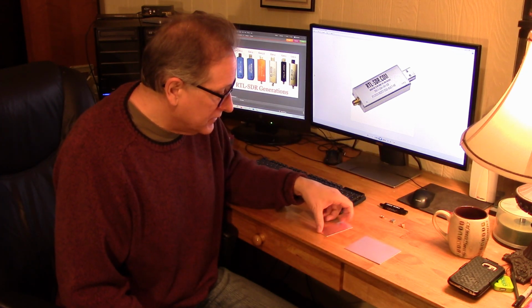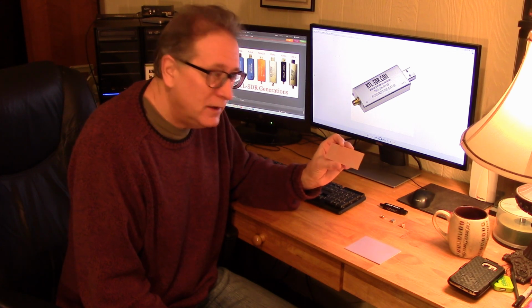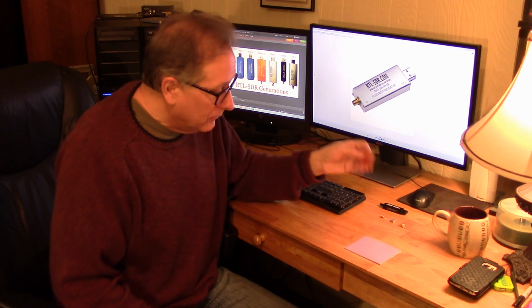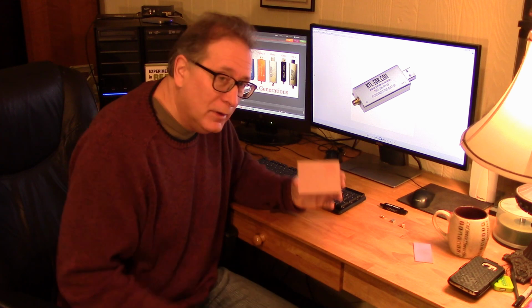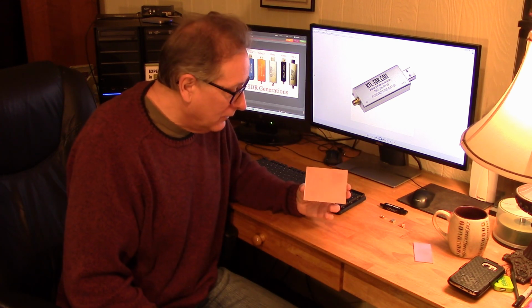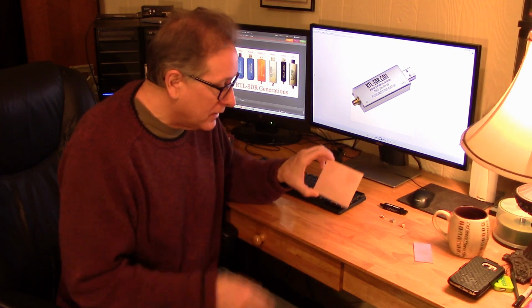Now, the entire thing, even if done haphazardly with some crude printed circuit board technology, could easily fit on a board about this size. But I'm going to purposely overbuild it, or build it out on a larger piece where we can use some of our more primitive prototyping techniques, such as Manhattan style, ugly style, and so on. Because I want people to actually try to build this.